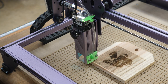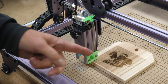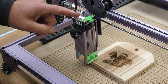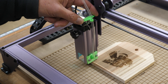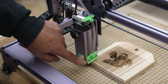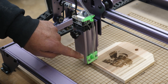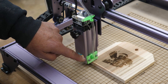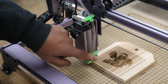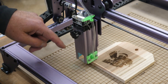We'll get a close-up of this. This is still mounted on the laser and I did a little test engrave on a piece of scrap cedar to try out a different speed for some photo-type laser engraving — just a test piece, not a finished product. This little bracket up here came from Thingiverse. It wasn't exactly for this laser; it was made to snap in to fit the base of a different laser. I cut those little ears off the end and drilled a hole in the laser head, then drilled and tapped two holes into the laser housing to mount this. The tube mounts right to that. The screws are not exactly parallel, but it works.